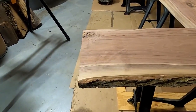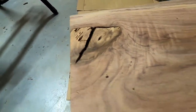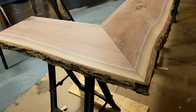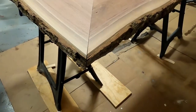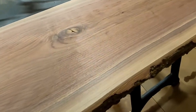What you're seeing here is an 11-foot long L-shaped walnut bar top with some great character, as you're seeing in this knot with a crack. There are also a few issues we need to address, such as sanding out these oil smudges. This bar top was actually in place for a while unfinished. When it was put together, the seam here is kind of a large gap, and there's also a large chunk of bark missing there. We're going to have to touch both of those things up before we do the epoxy pour.